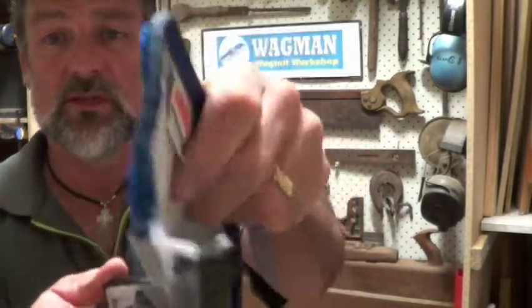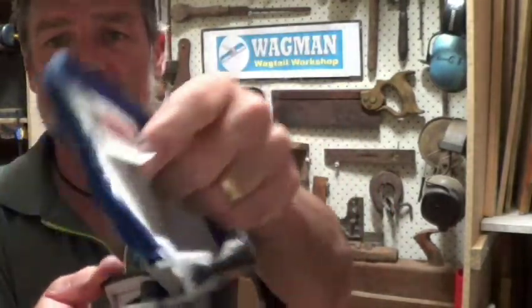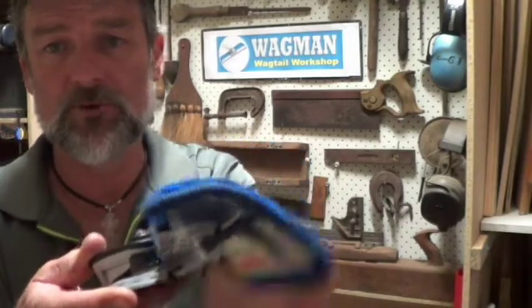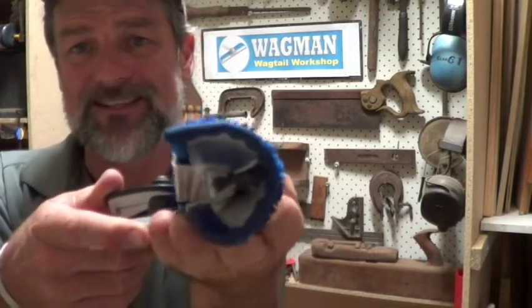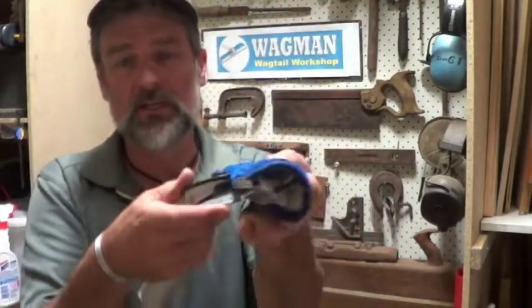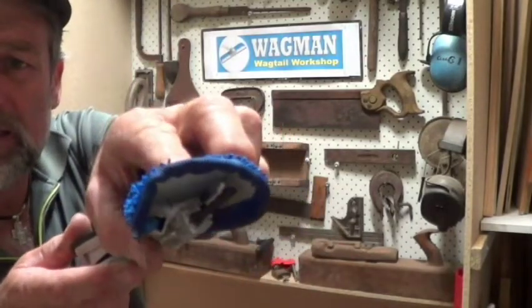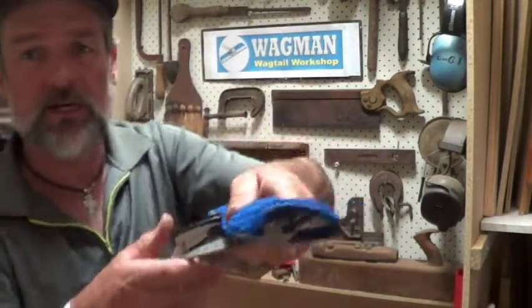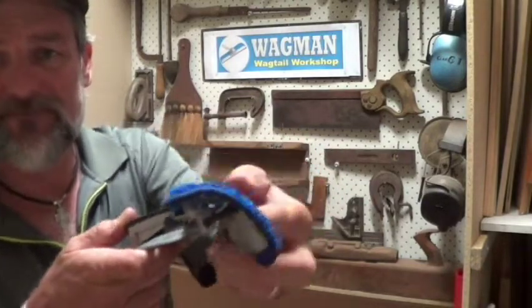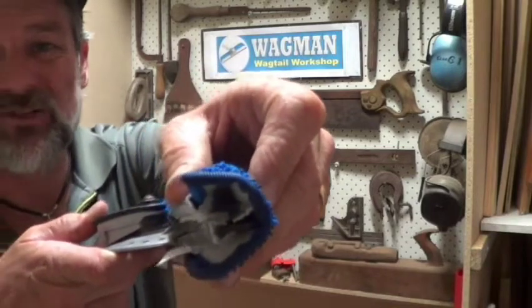When this pad is heavy with water, that pulls that over quite nicely. And it doesn't matter if it doesn't pull it all the way. It's just so that the pad is free to come up and over, and a lot of coverage underneath. Because once you start going up and down, if there's not enough coverage coming over the top, if this pad only came to there and you started to do the up push, it will pull that off, and you'll start to scratch. This has to have a lot of coverage over, and having this flip clip allows a ton of play for that.